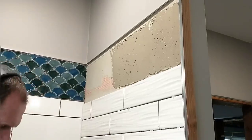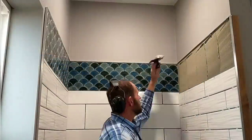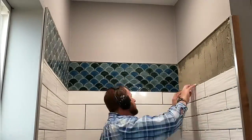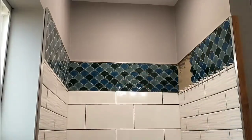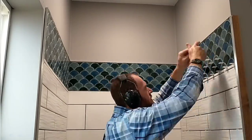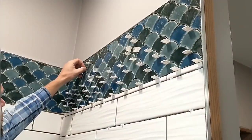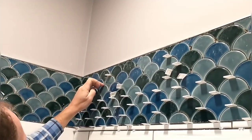I'm getting ready to put on the mortar one last time — getting this final section mortared and then I'll get the lines in. The first piece I'll put on is that thin piece along the bottom, which actually worked out better than we expected. It's just a half-inch wide piece of white and it ended up looking like trim, so it worked out really well. Then I'm putting in all the little spacers as I start to put in that decorative tile piece. The tiles want to compress and the gaps between individual tiles get too small, so I'm using tons of little wedges trying to keep the spaces between tiles uniform throughout — it's quite a meticulous process.